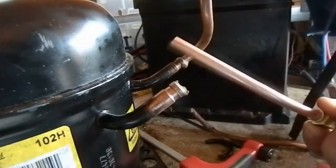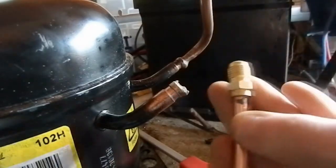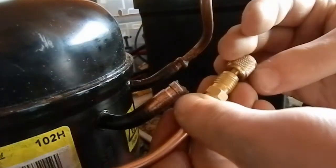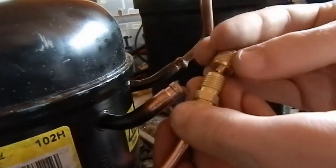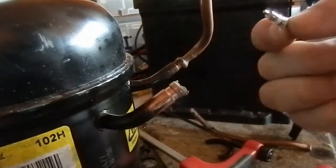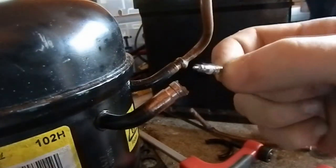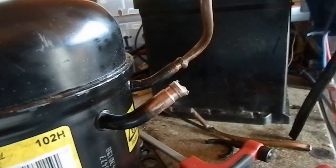I've decided the whole thing is a little bit long so I'm going to cut it shorter. You should also remove the valve core — usually service valves come with a core remover, so you just put the cap in, twist it around, and it comes out. The reason to remove it is so you don't melt the neoprene or rubber seal by the heat. Then just leave that to the side.